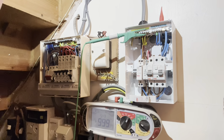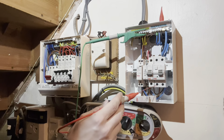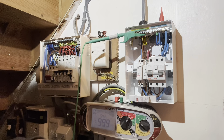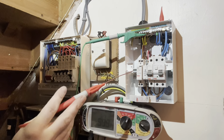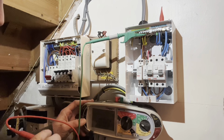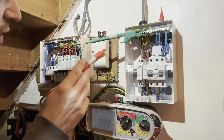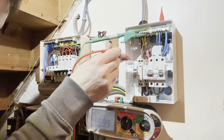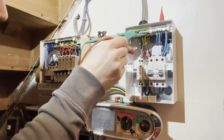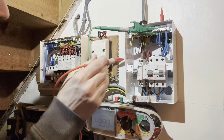Hold test and press the red padlock button to lock on the insulation resistance - love that little trick. Incoming line and neutral is double pole, so per BS 7671 going between neutral and MET I should get 999. There's a reading through the neutral and CPC because of the earthing arrangement - we've got a TNS here so we may not get a reading on that. Now going CPC to line of the new shower number two, then line to CPC of the priority shower number one - wicked.